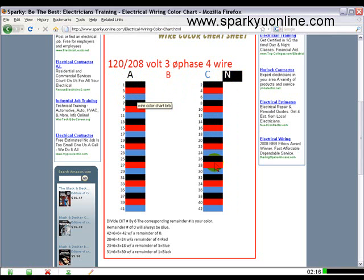So this color chart will help you out a little bit — you can lay it next to your panel while you're making it up and just double-check real quick. Let's say you're running through and you pull up a wire marked thirty-five and it happens to be red — that could give you an indication that there could be a problem there.